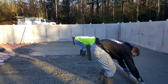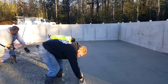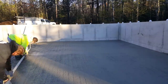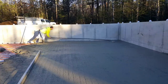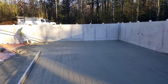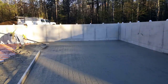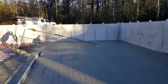See Darren — I had it a little high there on his pad, so we stopped and cleaned it off to make sure it was perfect before we continued, because we don't want it running a little high or low. Luke's really raking that concrete out of there. So there's about half of it done, all screeded. Now we're just going to bull float it real quick — smoothing it right out, which is going to make it a lot easier when we go to power trowel this thing. We'll end up power troweling it; I don't have that in this video, but I'll have a video linked at the end if you want to see how we power trowel floors.